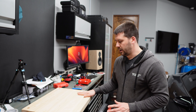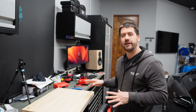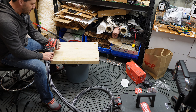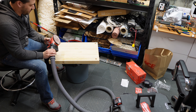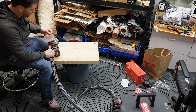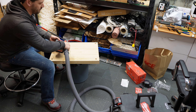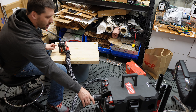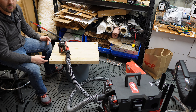These are rubberwood and have a clear satin coating on them, so I'm working on sanding them down. I'm using the Milwaukee M18 random orbit sander — I just picked up the cordless version and I'm going to get rid of the corded one. I try to buy a new tool every time I build something. I'm using 120-grit sandpaper to remove the coating, then going over it with 320-grit to make the finish nice and smooth before applying stain. I've got it connected to my Milwaukee dual M18 vacuum running on mode one, and it's really sucking up all the dust.